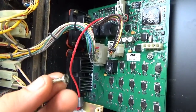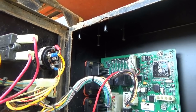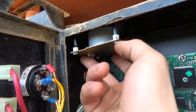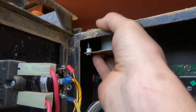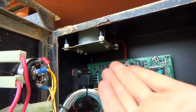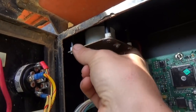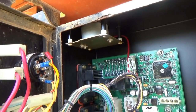Does anyone have any ideas how to better attach this tilt sensor? In my toolbox I found a cleaner looking screw with the same thread — let's just see how that holds up the tilt sensor by one corner. Here's the screw installed — it's pretty decent, but it can still shift because these are plastic little spacers. We still need to attach at least one more corner on the far inner. Here's my temporary solution — just the metal nut — I think it'll hold for now, at least for further testing. So let's fire it up and see if it levels itself out, what the pressure transducer says, and if it can go up at all.